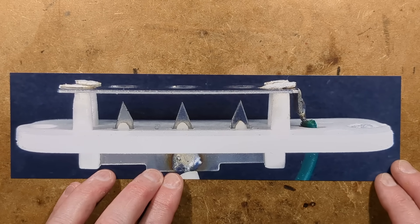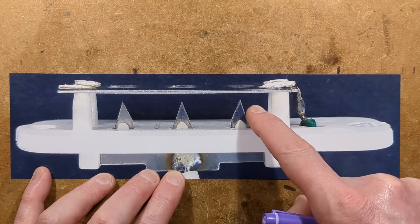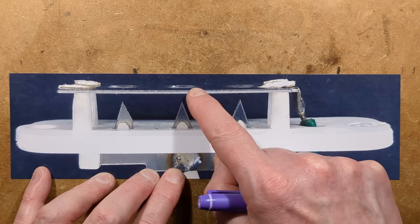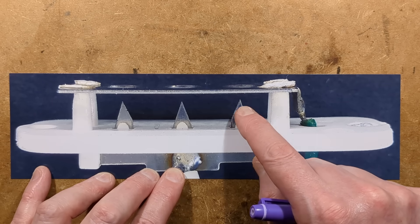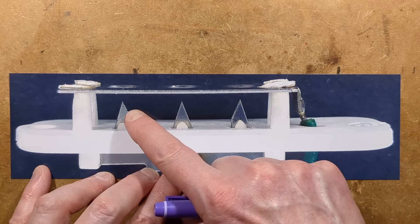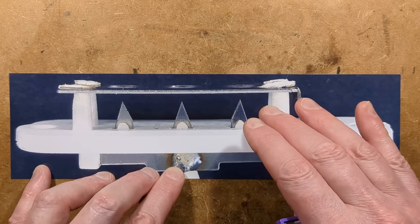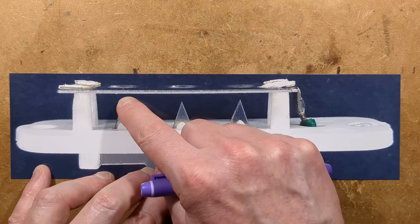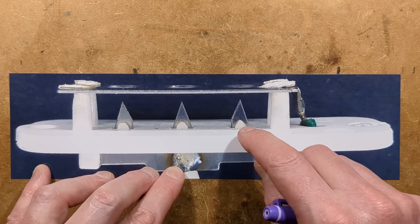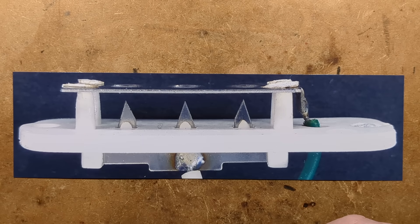The emitters are very reminiscent of my Russian Nuclear Corporation project. It's stainless steel punched with three spikes and a little stainless steel plate with three holes directly in front. It applies a high voltage — usually negative on the spikes, positive on the plate. Because the spikes are very close, it causes a near short-circuit where electrons charge the air and transfer across. This is so vigorous it creates an airflow. At the tip of each point you'll see a slight corona discharge — in a very dark room, the tiniest hint of purple. Corona means crown and has nothing to do with coronavirus — it means you get a little spray of energy at the tip as it breaks molecules in the air apart, which reform in various forms including the desired ozone for the deodorizing effect.